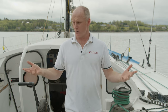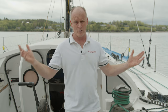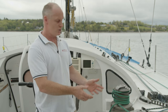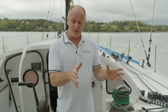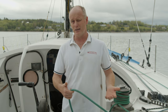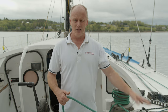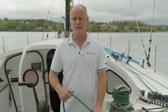Welcome back to the Spartan seamanship course. Today we're looking at winches — a key part of what happens on the boat. Without the mechanical advantage that winches provide, none of what we want to do can happen. We have two-speed winches, three-speed winches, and three-speed winches connected to the grinder. We're dealing with rope that has a breaking strain of 8,000 kilos, operating at about two-thirds of that. These winches can generate enough force to pick up a couple of trucks.